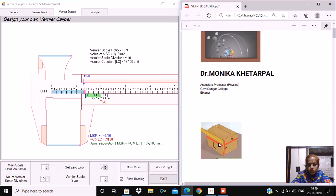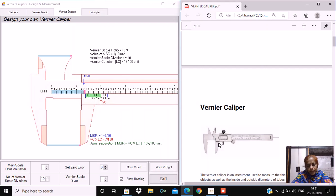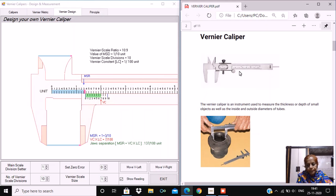In order to find the precise measurement of either the length, width, height, or diameter, we have to change the tool. For this purpose, we will use a vernier caliper. Vernier caliper is a measuring tool that will give additional accuracy to the measurement as compared to a ruler. This vernier caliper can also measure the thickness or depth of small objects, as well as the inside and outside diameters of a tube. For example, here I have shown a hollow tube, and using this vernier caliper, we can measure the inside as well as outside diameters.